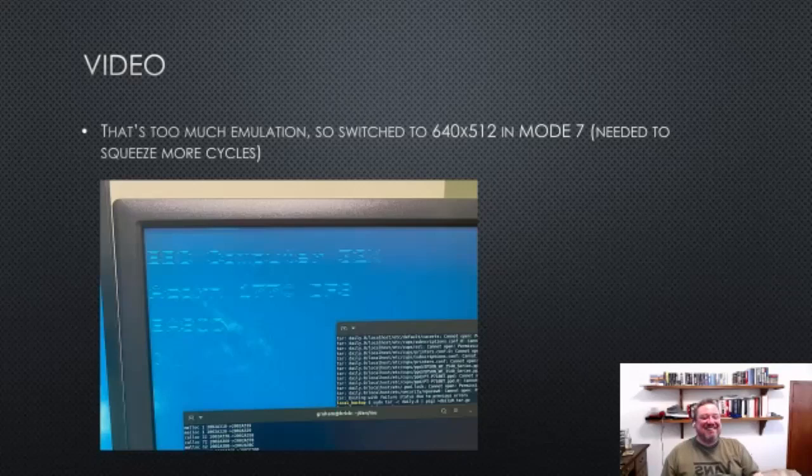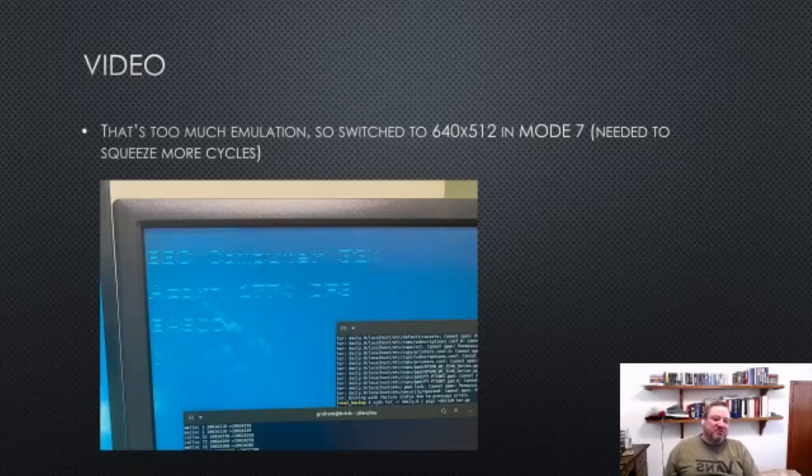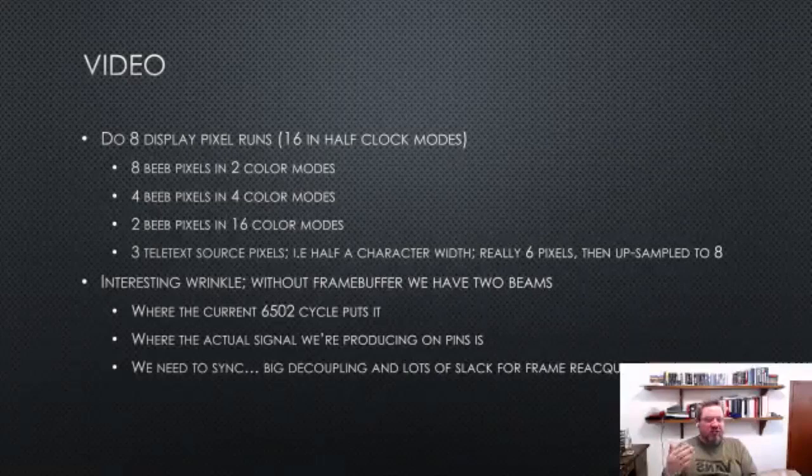And the reason it turns out, it seems, especially with all the Dell monitors until recently, is that they really don't expect alternating fields of close together black and full intensity white and black. It must confuse whatever auto hardware they have, but fortunately, it isn't permanent, though it's a little scary because it lasts, you have to sort of wipe it with another window. It slowly fades over time. But I was like, okay, we've got to not do that. People will be upset if it happens to their TV. And so I moved on to doing 512 scan lines, like you said, to speed up the code some.